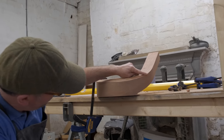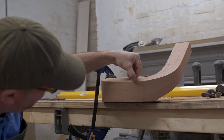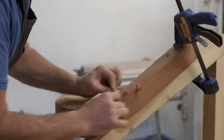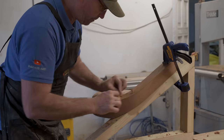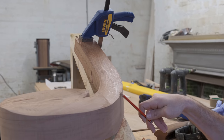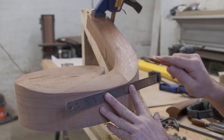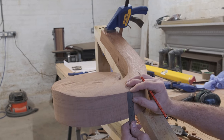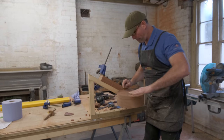That line looks lovely running all the way through, and then all of a sudden, just at this point, it starts to raise up here, doesn't it? See it? So the one thing I'm doing is I'm going to level that up. It flows, and then it hits here. Look, you can actually see there's a bit of a lump there. So that measurement from the bottom here is 78 mil. That is going to represent the top flat part of my monkeytail.